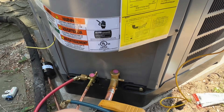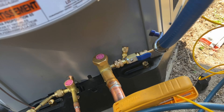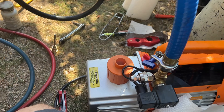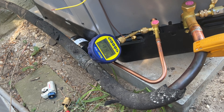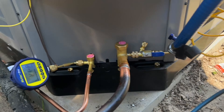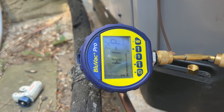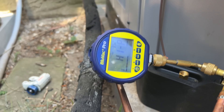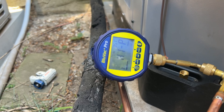I got the vacuum pump hooked up with the True Blue gauge and True Blue hose — one hose since I only have one port on the vacuum. My gauge is at the farthest point from the vacuum to give an accurate micron reading. We're reading about 9,000 microns at the vacuum and just starting to pull out of high pressure on the Blue Vac Plus Pro micron gauge, pulling from the evaporator coil all the way through. The reading is at the very end of the system, so it's definitely going to take a while.